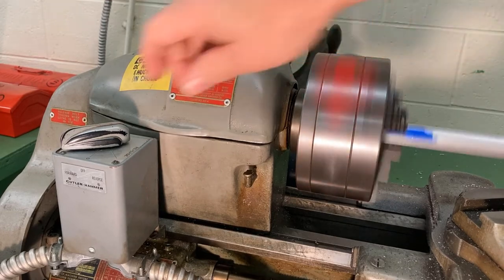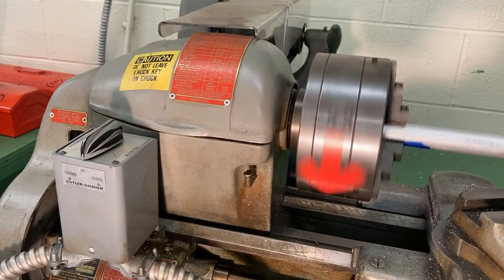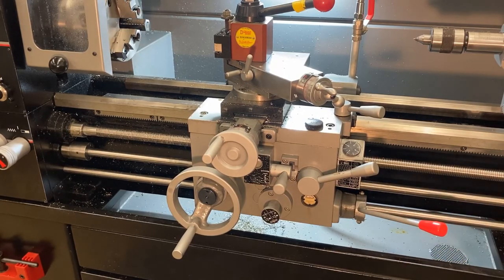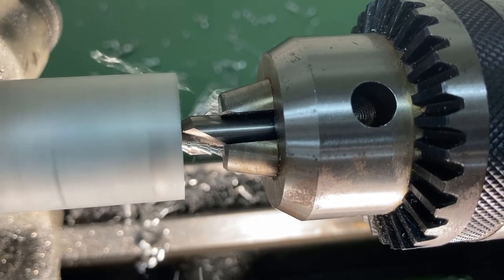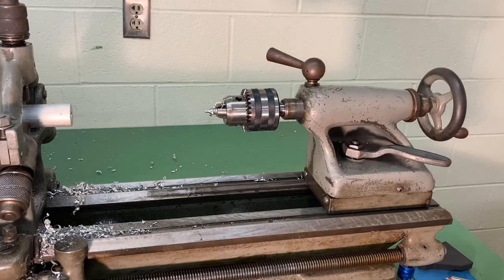Power on the lathe. It's important to check which way the spindle is turning — there is only one correct rotation direction in this class: the top of the chuck should be coming toward you. On this lathe it's this drum switch; on some others it's a red lever. With the spindle going, feed the drill bit in to the proper depth — remember about 80% of that cone shape needs to be filled out. Then retract, turn off the lathe, and remove your part. Now you're ready for the next step.